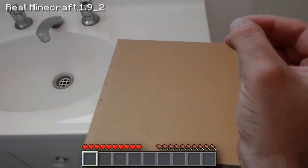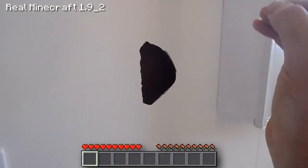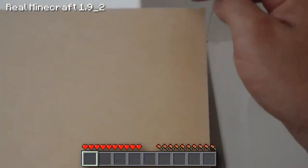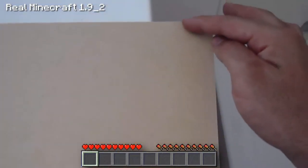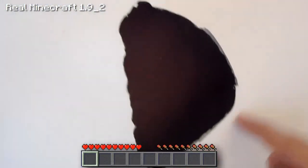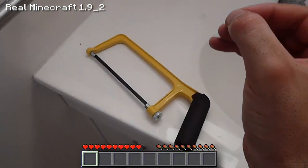We're going to fix a hole in the wall using a bit of plywood. Now the first thing you want to do is get some glue. I've got some epoxy in those bags down there, but you've got to cut some strips, probably 2 to 3 centimeters wide, across down the bottom there. Then you glue that on the inside of here, so you can cut out the board to fit in that hole. Then you can putty up around it, sand it and paint it. But I'll cut those strips and show you what I mean using a little coping saw there.